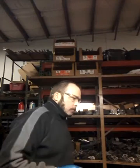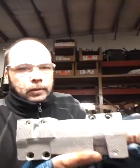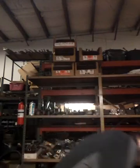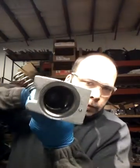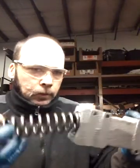Okay. So I've already broke down this door closer. This is the door closer body, of course. Got your adjustment valves, back check valve, remove the positioning valve, and the spring and everything. This only has one spring. Some of them have dual springs. If you have dual spring, the other spring would go right inside that one. So anyway, I'll make sure this winder piece is freely spinning in there and nice, which I did.